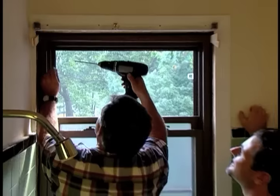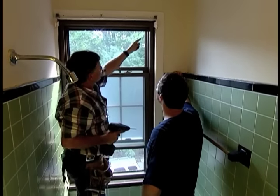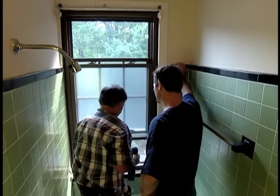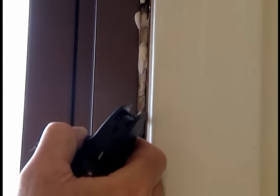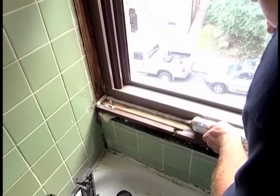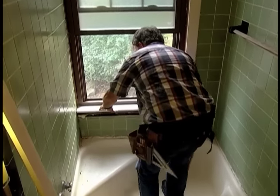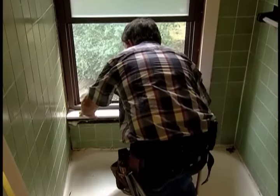These are two-inch stainless steel screws that hold the window into position — I've got one on the top and one on the bottom on each side. That's insulation that you're going to put right in between the old jamb and the new unit. That bead of caulking is going to make a real good seal against water. The trim, PVC, really doesn't care about water.